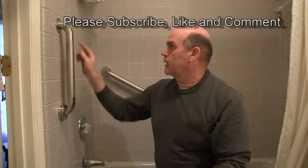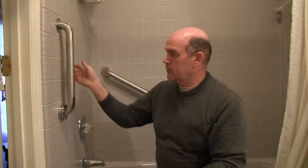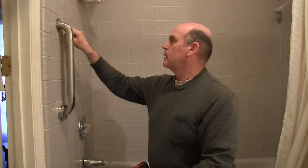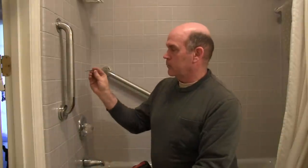So it should be plenty strong. Even though I only have one screw on each of these right now, it's pretty darn strong already. I'm going to go ahead and put the other four screws in. To recap: lay your handle out where you want it and mark two holes. Set it down. Drill through the ceramic tile in both spots, then drill all the way through the backer board and drywall with a pilot size bit. Once you get it fastened up with two screws, then you drill the rest of the holes through the tile and then the pilot, and you're all set to drive screws. That's the point where I am right now — I'm driving screws.